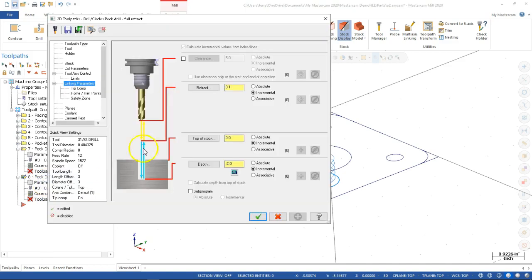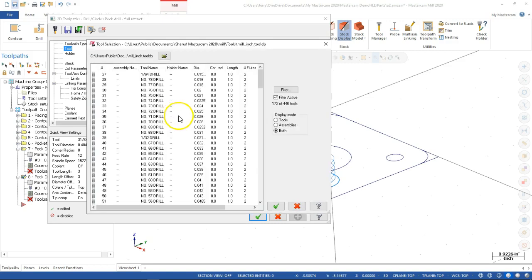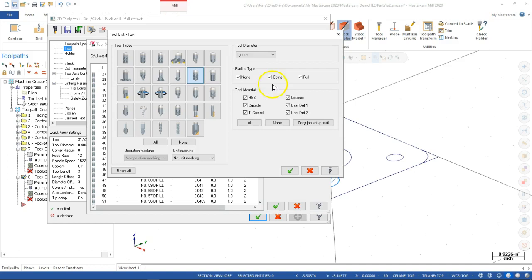And then on the parameters, we go back up to the tool and see what we have available for the reamer. One of the things that is always a concern is that reamers have a lead chamfer, and it's going to vary between 20, 50, 60 thousandths depending on the size. If I don't know that, or it's not in the library, then I'm going to have to grab the tool and measure. We're just going to guess and say it's about 60 thousandths.